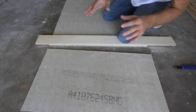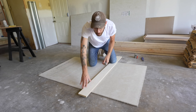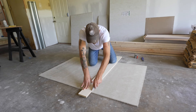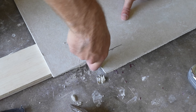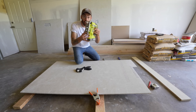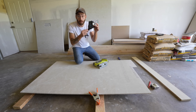What's great about this is it's really low dust. You can also use a sharp utility knife for this — just know that you'll run through blades. This takes about the same number of passes or scores. The nice thing about being able to use a utility knife is that pretty much everyone has one, and you'll need one on hand anyways because it's great for cleaning up corners. A jigsaw is also effective for cutting fiber cement board, just make sure you mask up before you do.